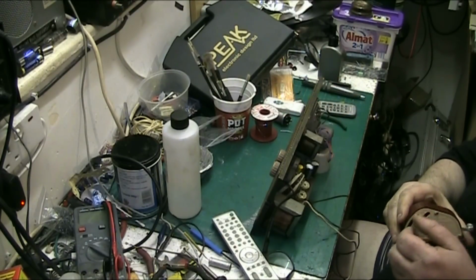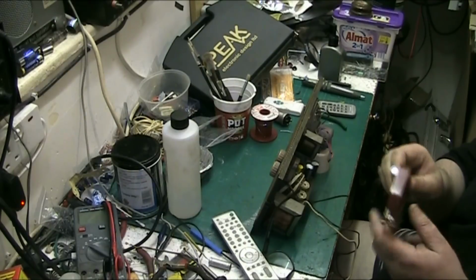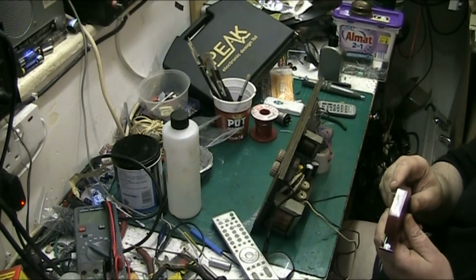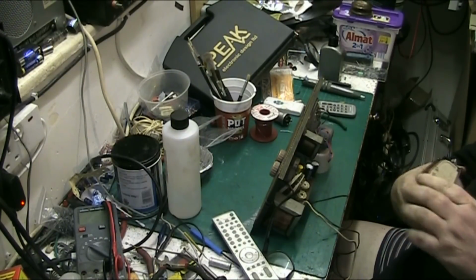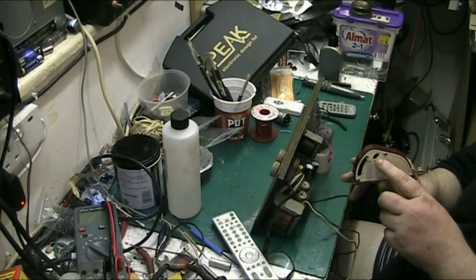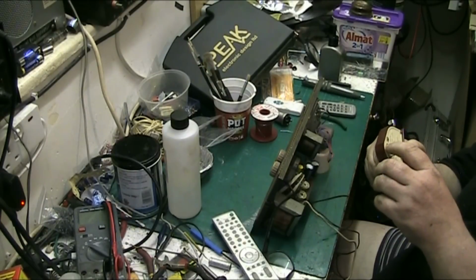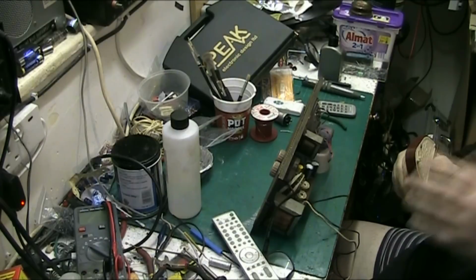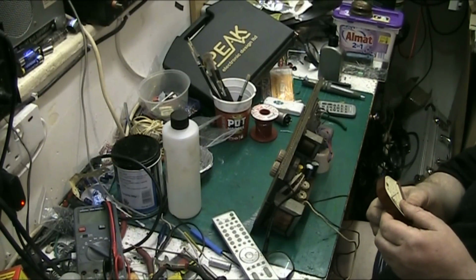You put your stylus in the pan there, and you press that lever with your finger, and you read it on the scale down the front there. Simple, but effective. You press it down, and you read it through this little window at the top here. There's a little indicator in there, and when that indicator's in the middle, that's how heavy your stylus is, that's how much pressure you're putting on it. The Garrard stylus pressure gauge for micro groove pickups.